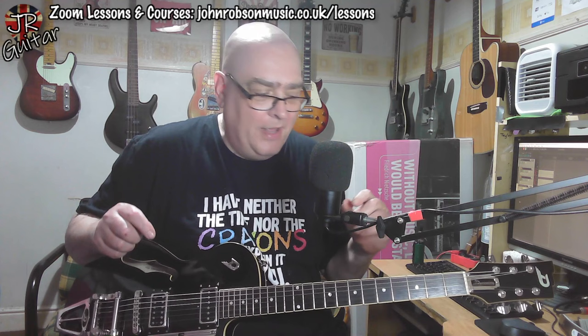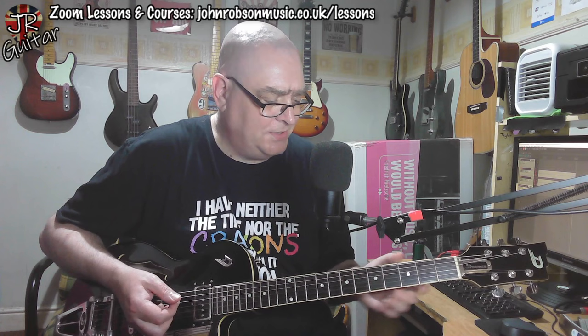And bear with me on this. When you have multiple resistances connected in parallel, like the resistance of this humbucker and this P90 in parallel, which is what you get when you've got the pickup selector in the middle, according to my memories of my old college notes, the overall resistance will be something less than the lowest individual resistance in that parallel circuit, in this case the P90 in the neck. But the overall resistance is exactly the same as the P90 in the neck. So obviously there's something amiss here, some kind of wiring fluke that I'm not aware of.